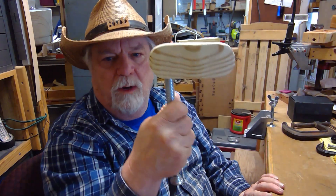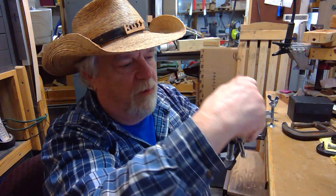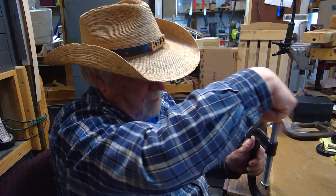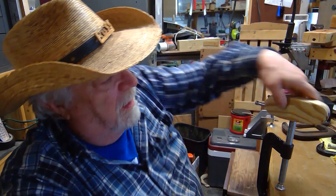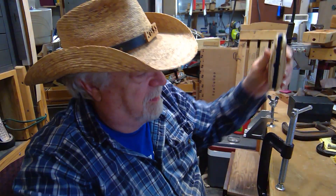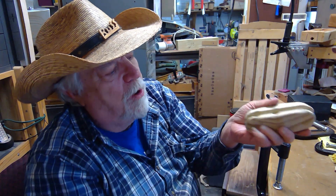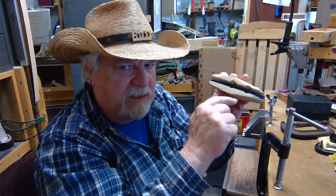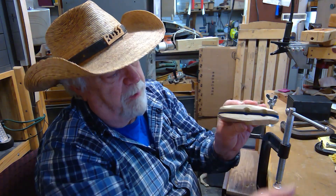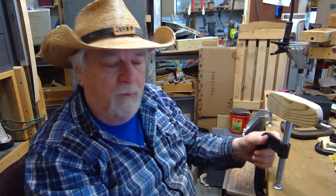If I want to, I can put it out to one side instead, and then you can just really easily spin it. So this is a great little handle. When you get it where you want it, you just put it on there and tighten just as tight as you want. I guarantee you, this thing is tight — you can get it much tighter with just a little cheater block. I did put some tape over that just to protect it because I also put a layer of wood glue over the top of the magnets since they were recessed, to make everything more level. Then I put tape on there just until everything gets good and dry so the magnets won't pop out. That's why the blue tape is in there. Anyway, it works perfect and works great on any kind of clamp.